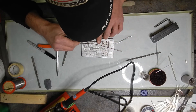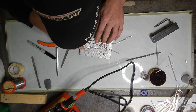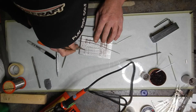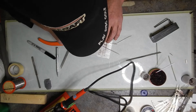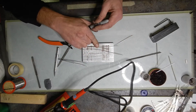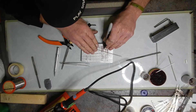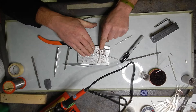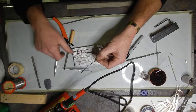Then dry fit it and see how nicely it sits up inside of here — paying attention to how far down it sits up against the jig. That doesn't fit too bad. Now mark this one on the other side — take your sharpie while you're holding it in there and use that little mark wherever the wing rail sits. Take note that with a sharpie it's not going to be perfectly accurate, so take a visual of it and note right where that section is sitting.